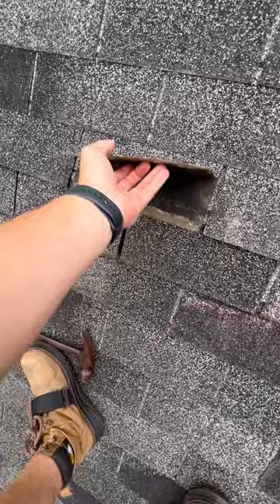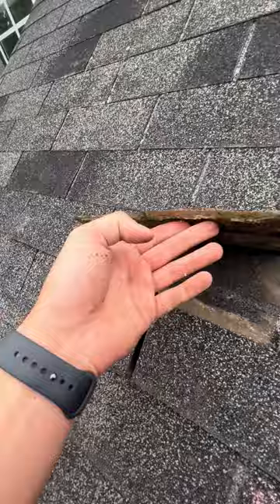We're going to have at least eight holes in this underlayment, and then at the very least four more holes going in. So we're going to have four holes in this underlayment that don't have nails going back through them. And I don't think it's good to put nails back into the same hole because they'll back out a whole lot easier.